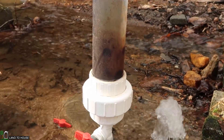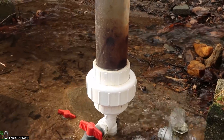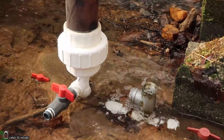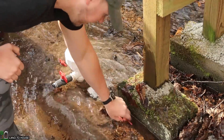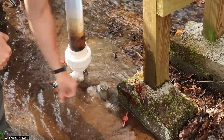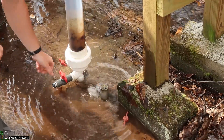Here's a really good example of debris stuck in a pressure tank on top of the ram pump. If it gets stuck into the waste valve, it can actually clog that up and cause some big problems. I'm going to go ahead and shut this off by turning the valve on the delivery pipe here. It doesn't quite close all the way because of my block here. Then I'm going to try and open this valve to let the pressure out.